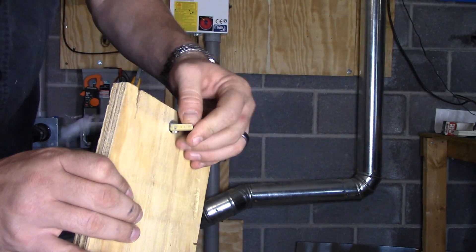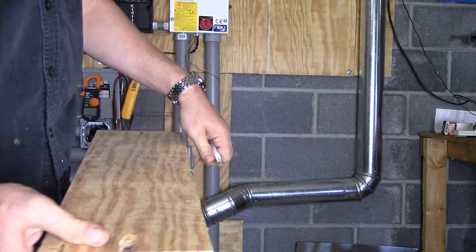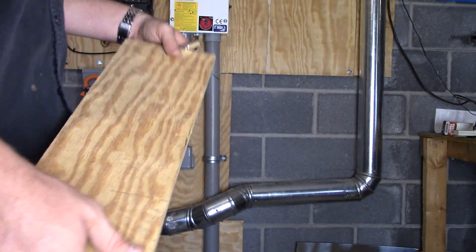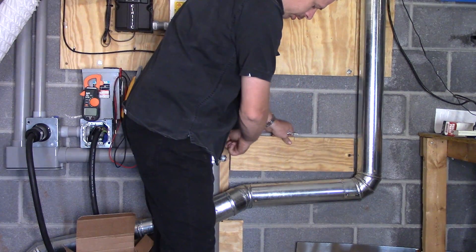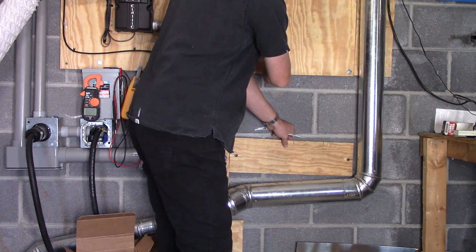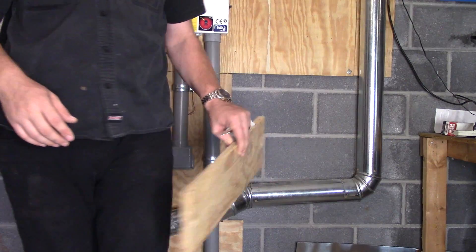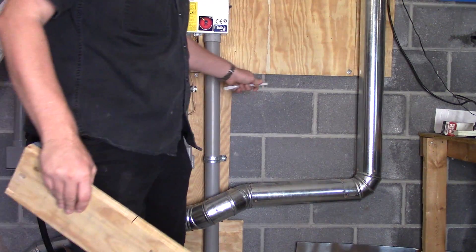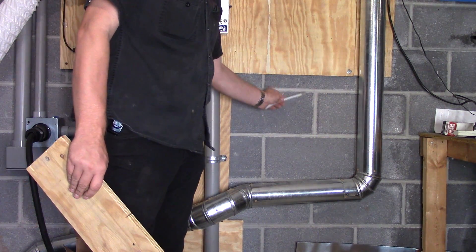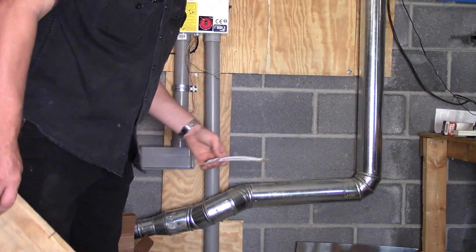This is just the beginning of mounting our equipment on the wall. The reason I'm doing this is because the equipment is heavy, so I want to bolt it to the wall. I'll be able to put two screws here and here for the bottom part of the shelf, and then here and here. I'll also bolt the inverter on top, and I'll have some backing that allows the back of the panel to stay cooler. Let's get to drilling our holes through the wall with the hammer drill.